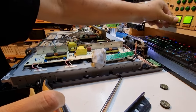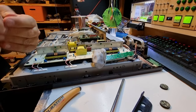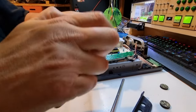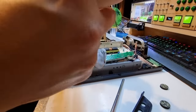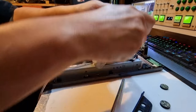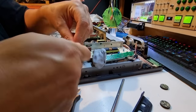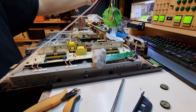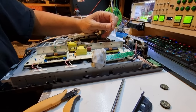Right here. There we go. Now our soldering iron has turned on. Let that warm up. We're going to strip some very short sections of insulation off these. The colouring is not terribly necessary in this situation, because it's just going directly to a contact closure. So we'll find some solder, get our soldering iron hot, and we'll be right back.